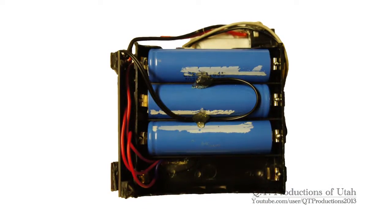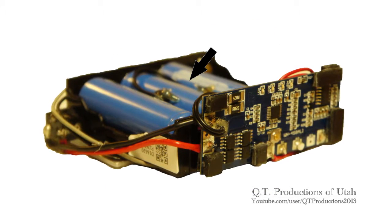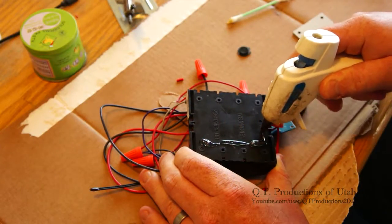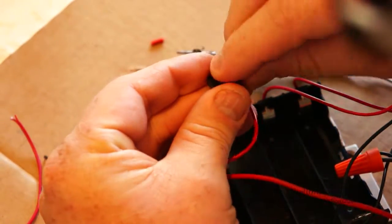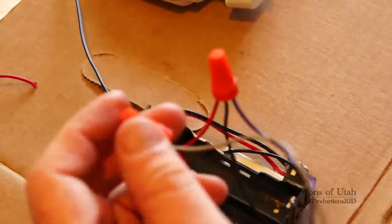For several reasons I made my own lithium ion battery. I salvaged 18650 cells from a dead laptop and ordered a PCM and battery cradle online. I used part of the old faceplate as a mounting bracket for the battery, planning to screw it to the inside of the box. I also used pieces of plastic as spacers between the PCM and cradle, and made a plastic button that can be pressed to show the battery's remaining life. I even recycled the barrel jack I removed from the amp and soldered the battery's leads to it.